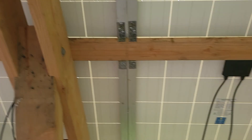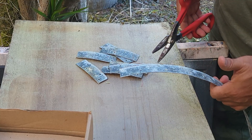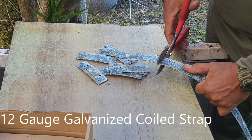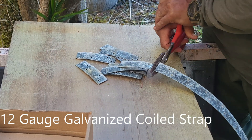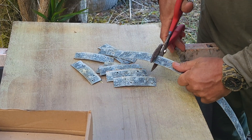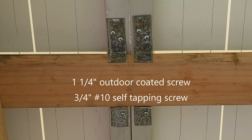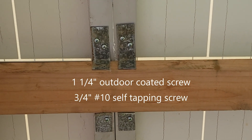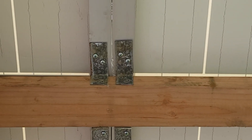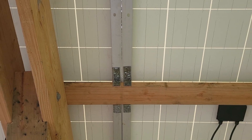The panels are connected to the purlins with the use of heavy-duty metal strapping. This is heavy-duty rack strapping — some people use it for racking in their houses also. Very heavy-duty. It's tied into the 2x4 purlins and into the panels themselves. I was going to use lag screws and washers but it really creates too much of a gap, and I'm trying to minimize the amount of gap because I'm going to waterproof this system.